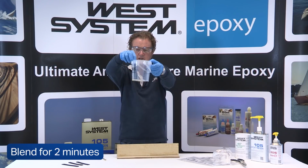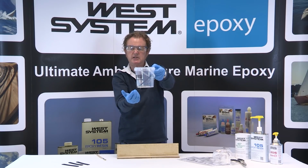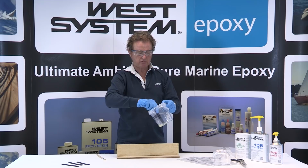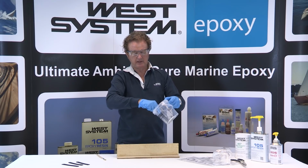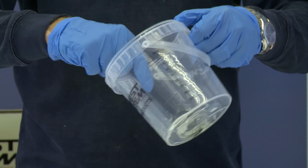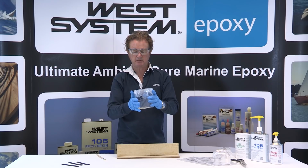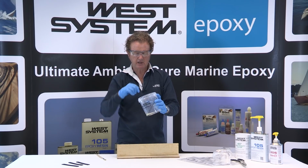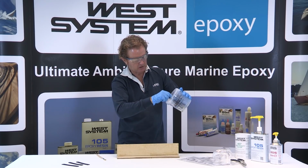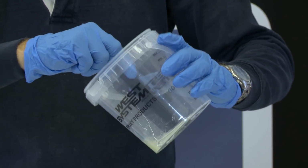And you can see I'm using a mixing pot that has straight sides and no rebate in the bottom, so there's no chance for a residue of unactivated resin hardener mix in the bottom of the plastic pot. A really good check on your work after you've finished and the next day is to roll the pot, break out the waste cured material and see if you have a residue of unactivated product in the corners of the pot. If you have, you're simply not mixing enough.